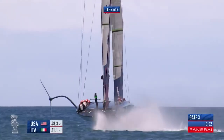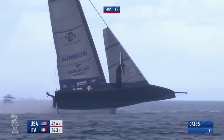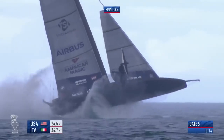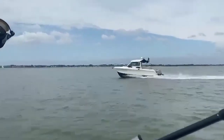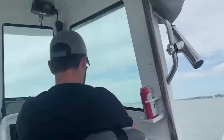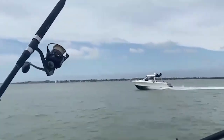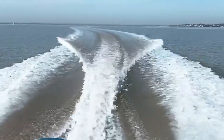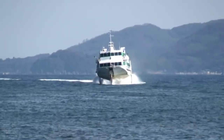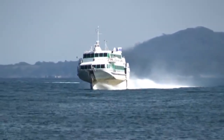When I say flying boat, I don't actually mean a flying boat — that would be called a seaplane. But most of you watching this would have seen hydrofoils, like here in the America's Cup, where these super modern sailing boats use hydrofoils to lift the boat clear out the water, just like how a plane uses a wing to fly. So why do we want to build a flying boat? Well, the main reason is for efficiency. Boats aren't exactly efficient — my boat does 2.5 miles per gallon. The main reason for this poor efficiency is the amount of drag that boats create when they push through the water. Hydrofoils, on the other hand, have very little surface area within the water. Therefore they're a lot more efficient, they produce less wake, and they're more pleasant to be aboard.